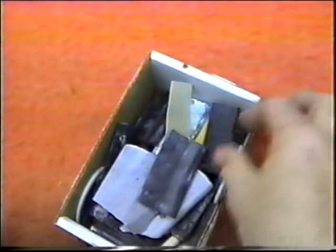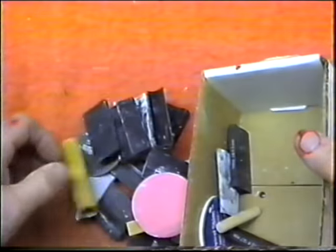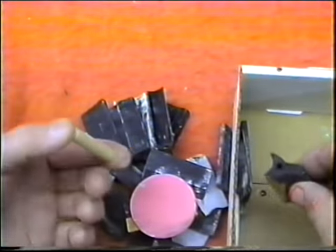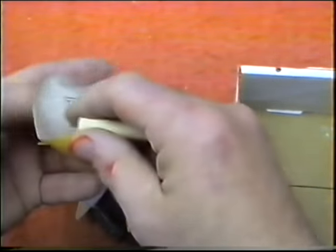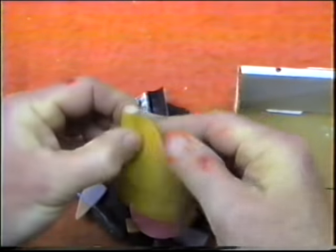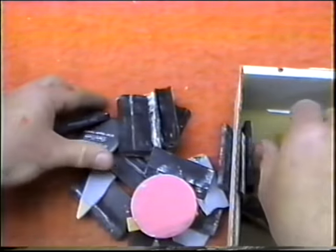The next thing is to set up the sanding tools, and I always make it easy. There's no point fooling around. A dowel will do. If you don't have any of these rubber things, you can always use a dowel. It's the right diameter. And what you do to get a grip on it, take some sticky back sandpaper, get the front even, and let the sticky back stick to itself. Now that makes a reasonable tool. That's usable. There's a lot better ones.